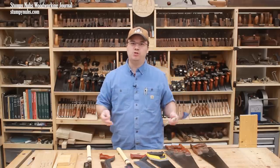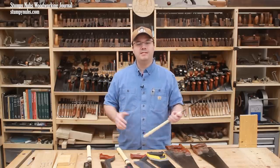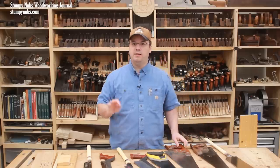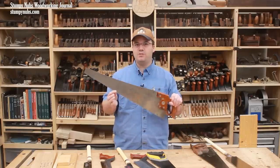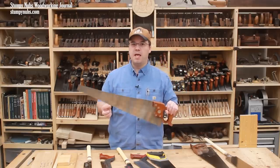And that's the problem with arguing about whether it's better to cut with a push or a pull stroke — not everyone treats their tools the same way or does the same type of work. In my case, when I'm focusing on accuracy and quality of cut, letting the tool do the work, I do think the extra weight and more aggressive teeth common to many western style push saws make them a little faster for dimensional rips and cross cuts.